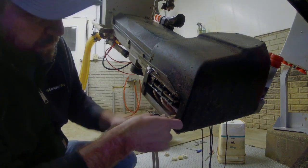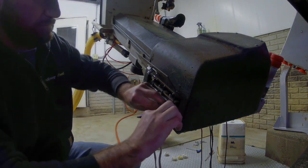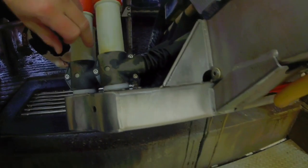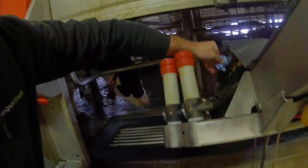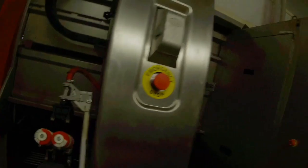We've got them all tightened up, so we're going to put all this excess rope back into the robot arm for the next time. Now we need to calibrate these — you can see they're really crooked, because the bottom of these little pucks are so rounded off that the cups are out of calibration. We need to get them straight up and down so that when the laser hits the cows' teats, they're right on the money. We'll put little pipes in here and do a calibration — the laser is hitting the pipes right there, and that'll tell us where we're at.